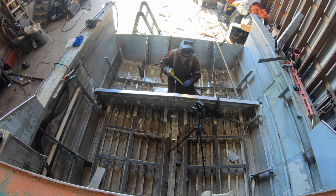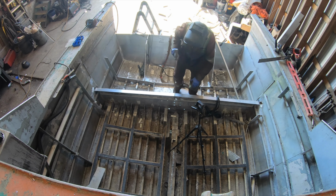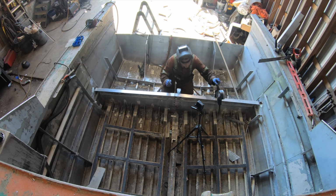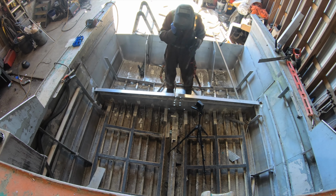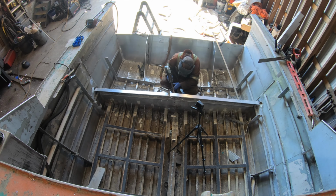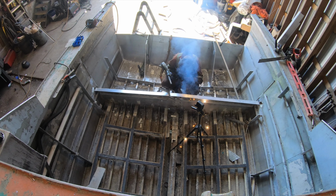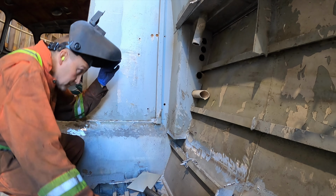So it's pretty wild. Any boat builders out there, I would think this would be interesting to them. Like you look, the whole hull on this thing is 1/8, right? They've put a 1x1x1/8 T that they welded in as stiffeners in order to keep the rigidity of the hull. Most times nowadays, from what I can gather, unless I'm wrong, correct me if any boat builders are watching this, it's like a 1/4-inch bottom, 3/16 up the sides. After you get to the reverse chine, that's 3/16, and it starts getting up into the upper structure of the hull, and that would be 1/8, right? But this thing's entirely 1/8, and they've tried to overcome that with the stiffeners. So very interesting. Anyways, it's neat to see the way they've done it.